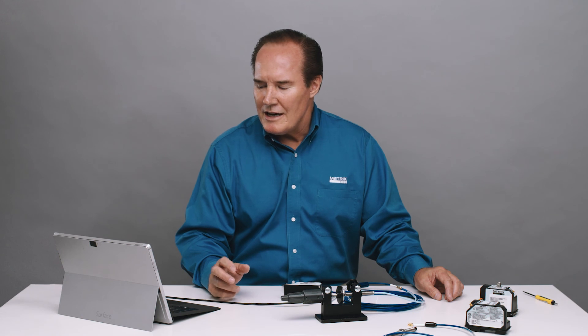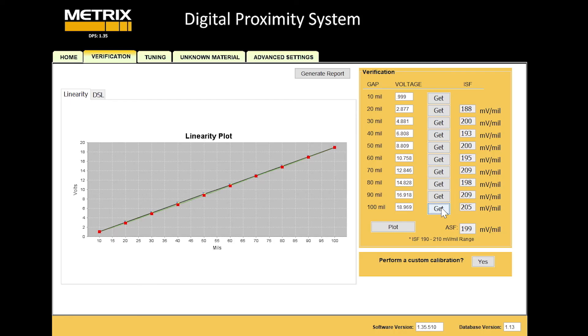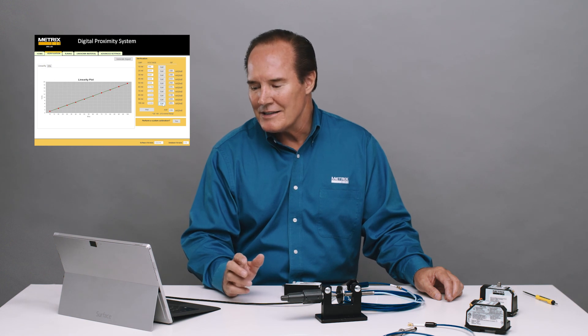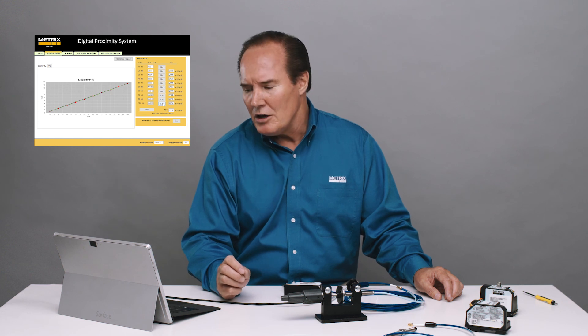You look at the data points and you see that 188 is out of spec — it's below 190. Well, that's interesting, isn't it? The API says you need 80 mils of linear range. I could easily correct this in our system — I can do a tuning step and a custom calibration to get it perfect. But this is just what it looks like out of the box. You might say that's out of spec, but no — it's actually in spec, because you can go 20 to 100 and still meet the specification. In the sweet spot, when you're gapped at 50, you're right where you want to be, right in specification.